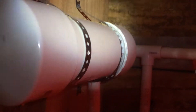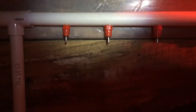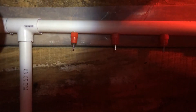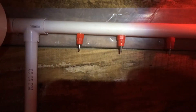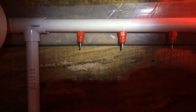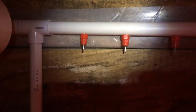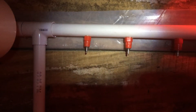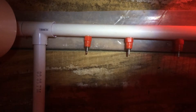Let me tell you a little bit about it. The system functions using these poultry nipples, which are not uncommon - you can buy them online for 50 cents a piece, pretty cheap and affordable. The key is these poultry nipples operate at a very very low pressure, like half a PSI to one PSI, so they can basically operate off of gravity.